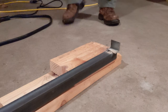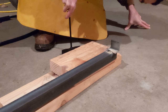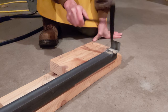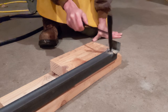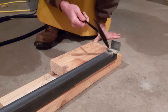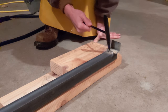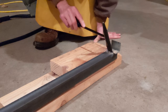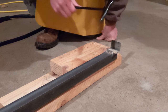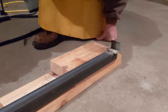I definitely felt better on that one. My tacks didn't do so well - I actually forgot about the whole tacking thing on the first pass. Let's see how this looks after I chip it off. That looks a lot better - a whole lot better. That could easily be cleaned up with the grinder, but it might be a little bit too much because it's kind of bubbled up. Either way I'm much happier with that. With some more practice we'll be able to get that down even better. You can see it's fully connecting from the bottom to the bar - that's sealed on there. Much better.